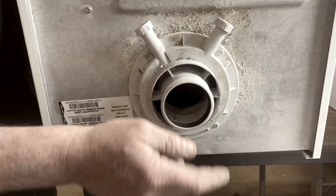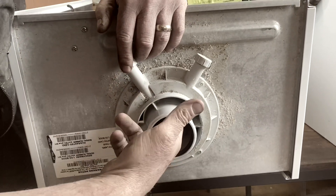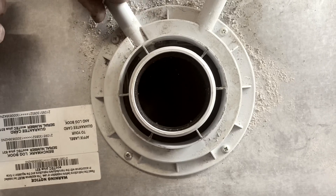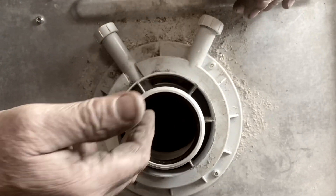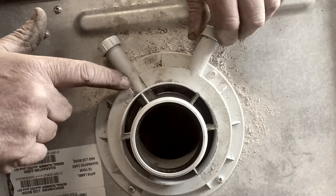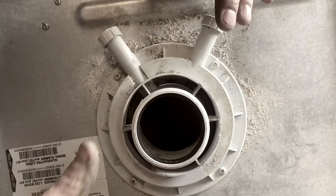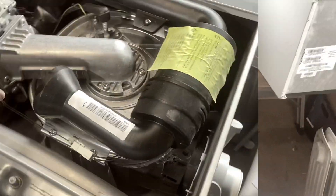Goes in there, out there. And these are the two test points. This test point, as you can see, goes right through to there — that's the bit that you're going to test for your flue gases. And this one here goes into there so you can test the integrity of the air coming in. So that's your flue turret through the flue.